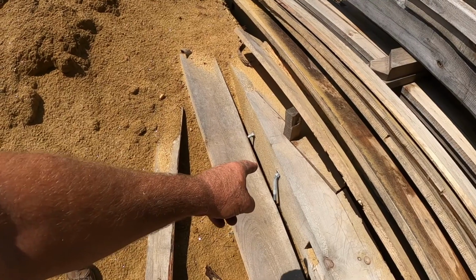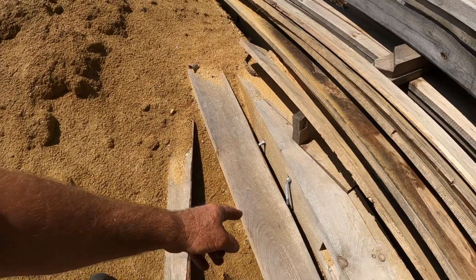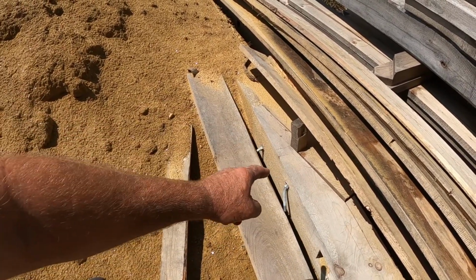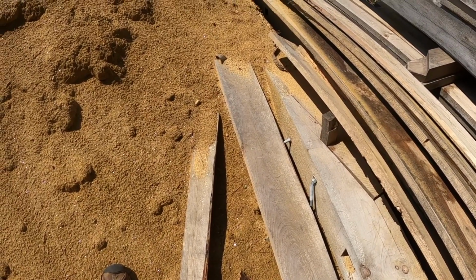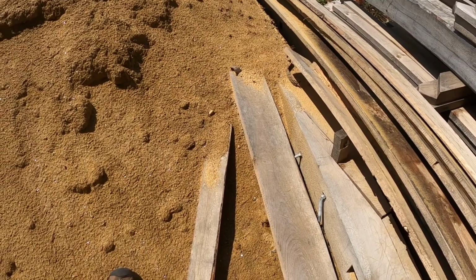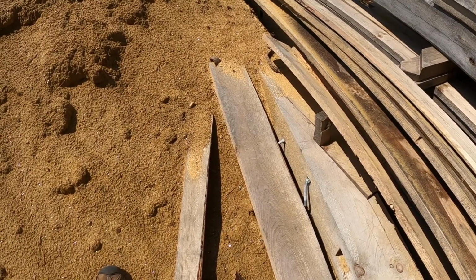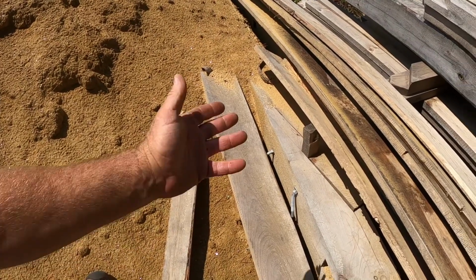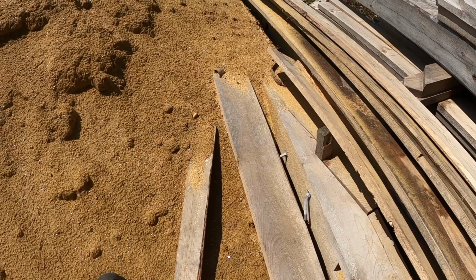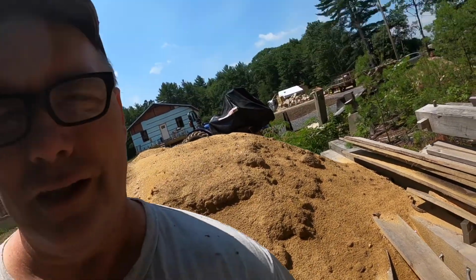This is actually one of the two top plates off of the sawmill shed that got crushed by that tree. And you can see what we're creating on the new ones. Those bolts actually held that thing together. The other one's actually in better shape. This joint does work. It's probably not the strongest joint, but with a big tree crushing it, it seems to sustain that blow. So I'm pretty confident that what we're doing is going to work out.